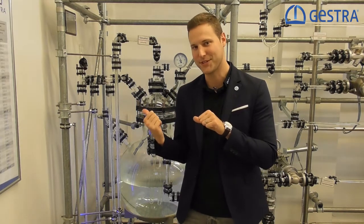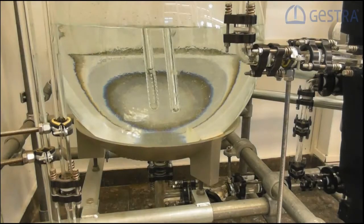Let's take a look at the glass steam system. What we got here is a glass condensate tank containing rather cold condensate at 40 degrees Celsius or 104 degrees Fahrenheit. We also see two injection tubes ready to inject steam directly into the cold condensate. As soon as we bring together hot steam with colder condensate, we'll create heavy water hammers.